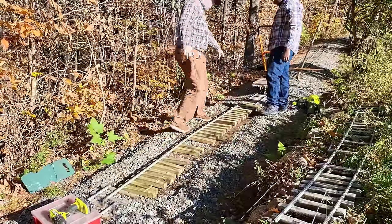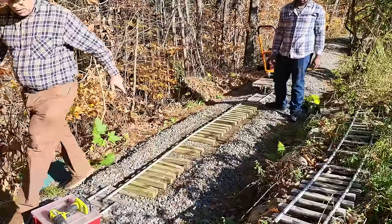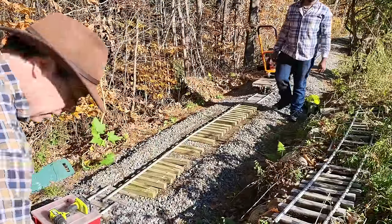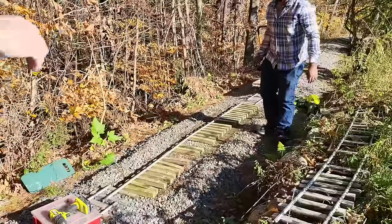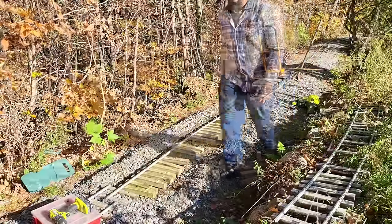You take two ties out there, put two ties in over here, put in all the stuff that fell out. All 8.5 ties. And reattach that rail. The other rail, we've got to straighten that one out, too. Now we have to kind of re-gauge it.